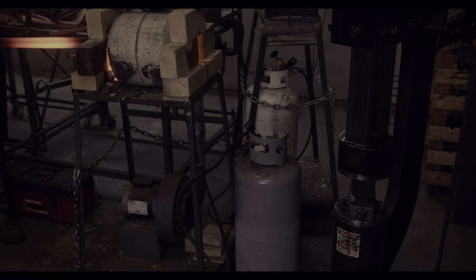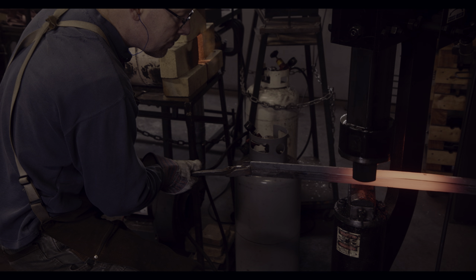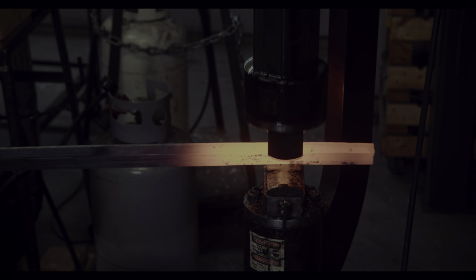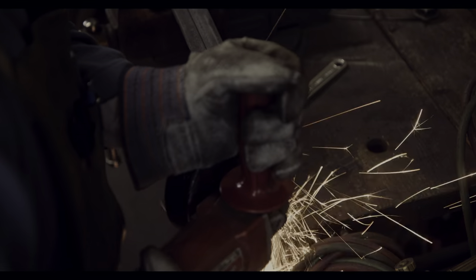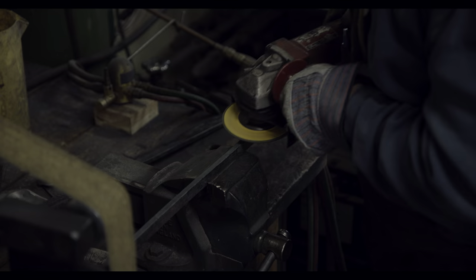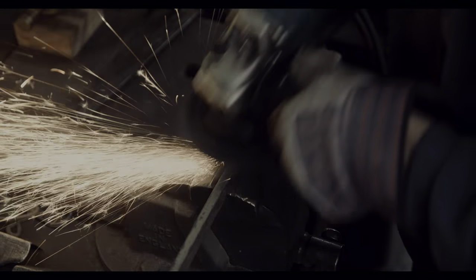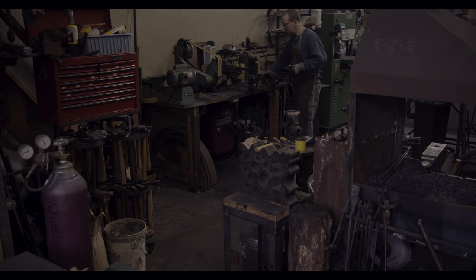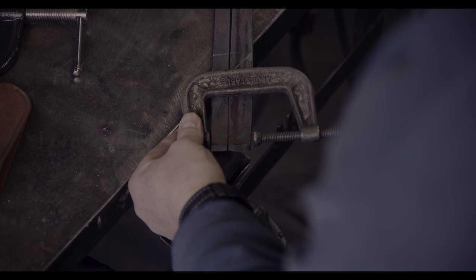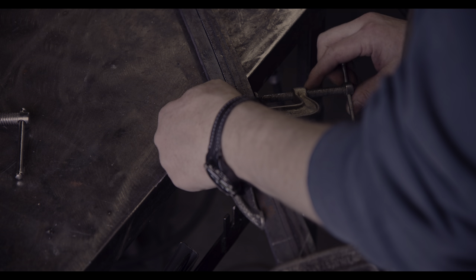As you may be able to see on the video, there is quite a big gap, and even with a lot of clamping pressure I was not able to work it out. After a few passes on the power hammer, I am happy with the results and will now separate the bars from each other. Since both bars have been exposed to heat, there is scale that I need to remove before I can forge weld. Now everything is prepared for me to clamp the bars together and tack weld them. I also place very small tack welds on the surface, with the full expectation that they will be completely ground out later.